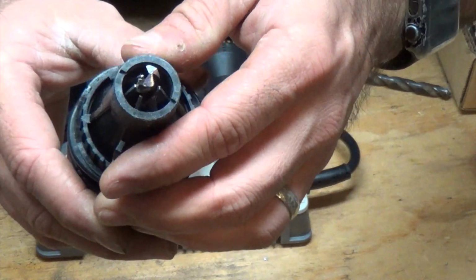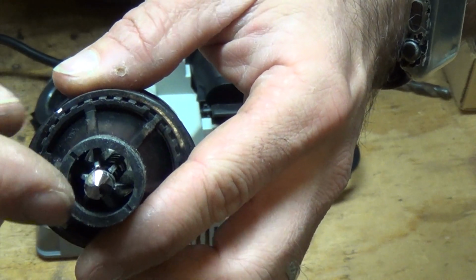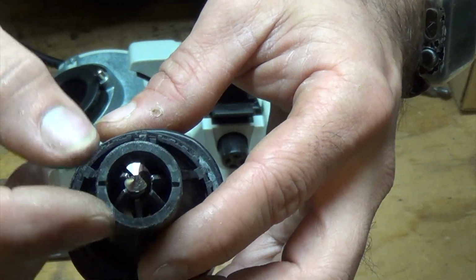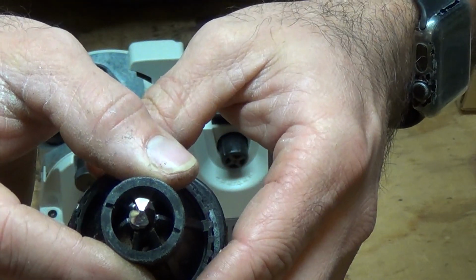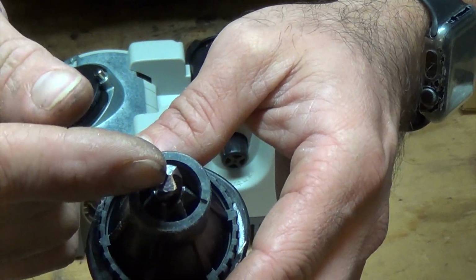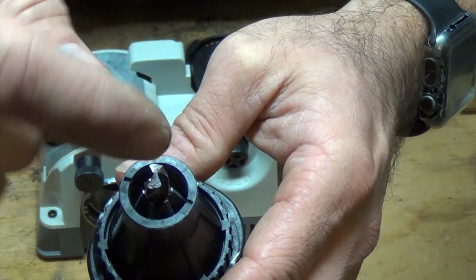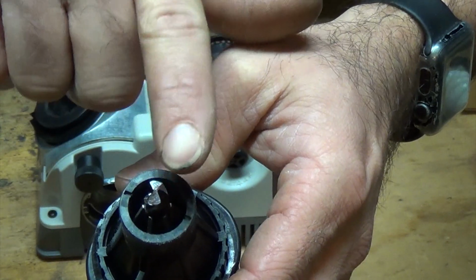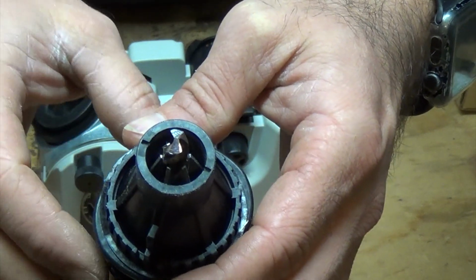Now let me show you what this is doing here. What it's doing is it's carving out on the back side of this, on either side, so that it's going to get that bow tie look on the point. And you can keep doing this over and over again until you start to get that bow tie. What you really want is for that to be a nice point where this angle comes in line with the other angle on the other side, and so that the back side of it does the same thing with this side over here. That way you get a nice little bow tie look.